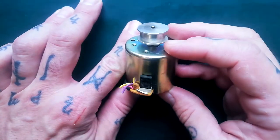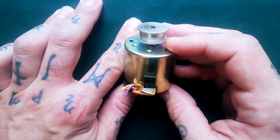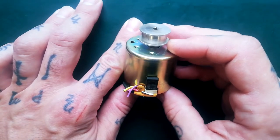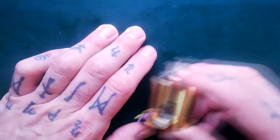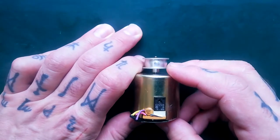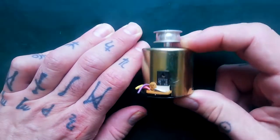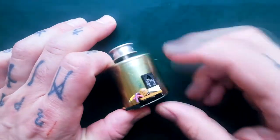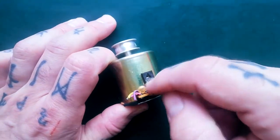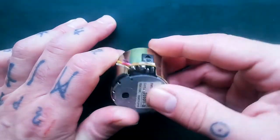This first style we're looking at is what you would find in TASCAM 244, 234, 246. Pretty sure that the TX144 motor - the main capstan motor anyway - these capstan motors all look a bit like this. They're fairly large and they've got some sort of motor control chip screwed to the outside of the casing, being used as a heatsink.